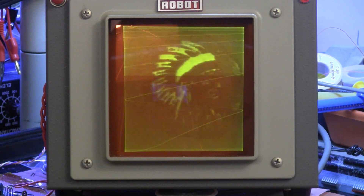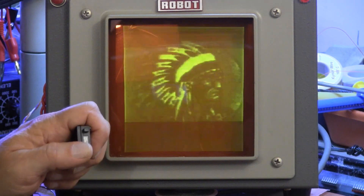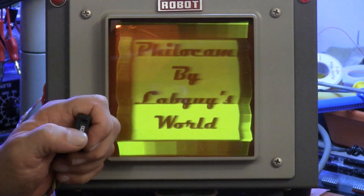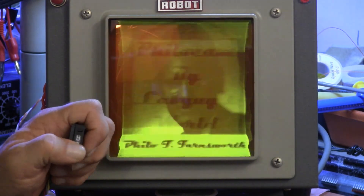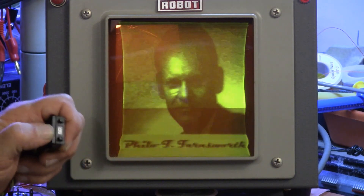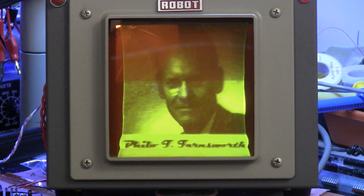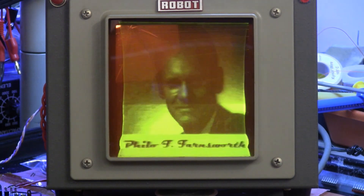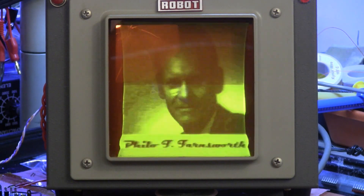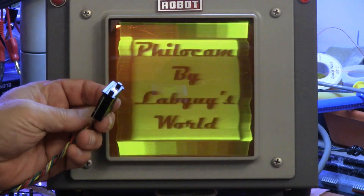When we get to image number nine, I have this little switch with push buttons. We're at number seven — zero to seven were the eight pictures I showed you. When I push the button, we'll come back to image zero, and then image one is in the nine position. What I'm going to do later — the logic isn't installed for this yet — when we're in eight and nine, eight will select the image dissector tube video and nine will select the image dissector tube negative video, so it will be able to scan negatives if I like. And now we're back at image zero, using one of these little thumbwheel switches for the image.